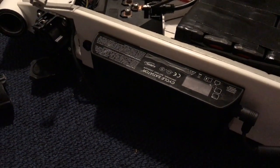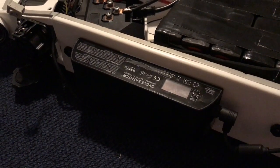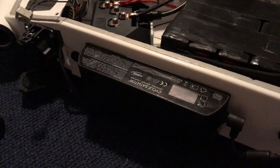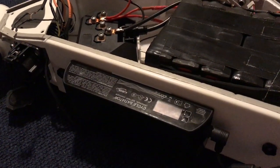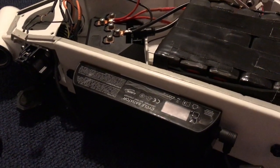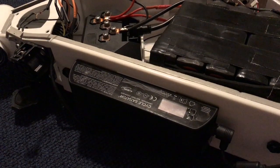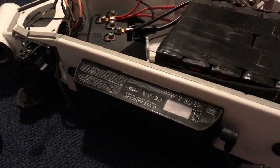The Cycle Satiator is a wonderful battery charger that allows you to program different voltages for your pack. Right now I have it charging my 72-volt pack up to only 85% capacity as the default, that way I can save my battery life considerably. As soon as you plug it in, the Cycle Satiator will just start charging, and I can use the buttons on the outside to change the charge profile up to 100% or less, or even change to a different battery pack if I desire.